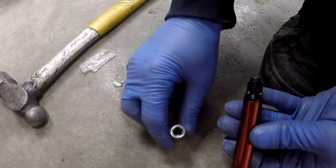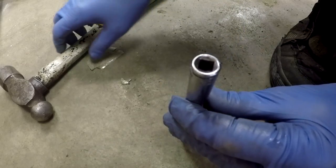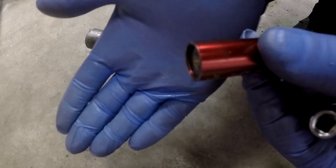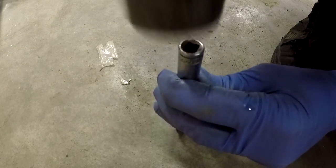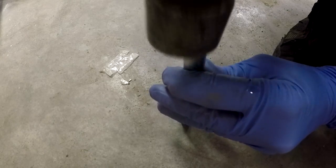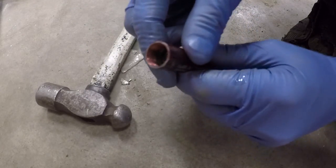So we have got our socket, we have got the body of our tool. We are going to place the end of the collet chuck on the floor, and the socket centered on the back of the motor. Now we are going to gently at first tap on it until we get it recessed some inside. See now that we have it kind of inside and we are sure we are not beating on the body of the tool, we can now hammer on it a little bit more aggressively. You want to pay attention to the sound — we will hear when everything seats together, the sound will change. Just keep listening to the sound. Right there, that is the sound that it makes now that everything is locked together.